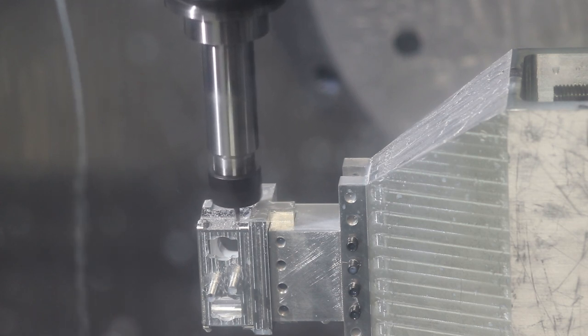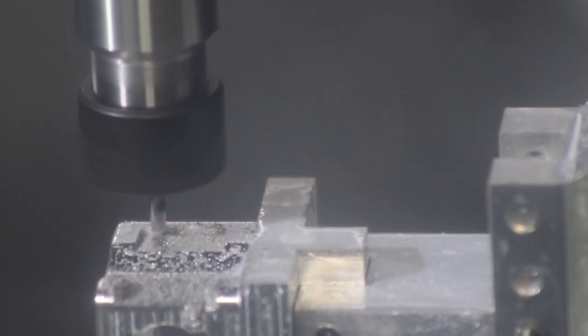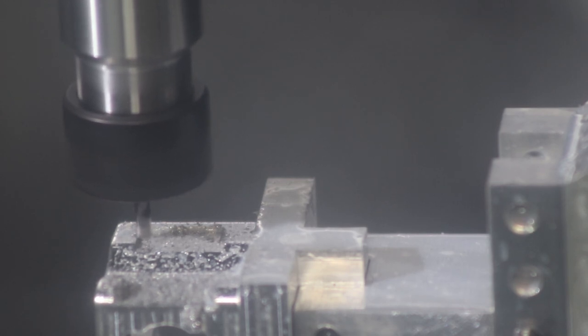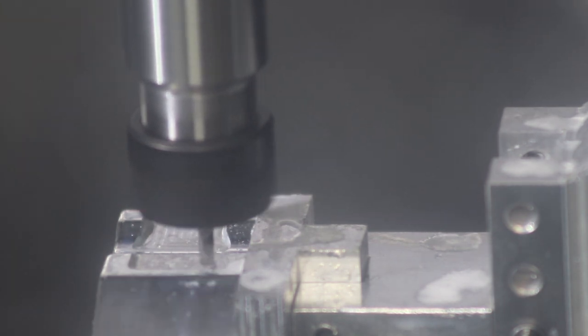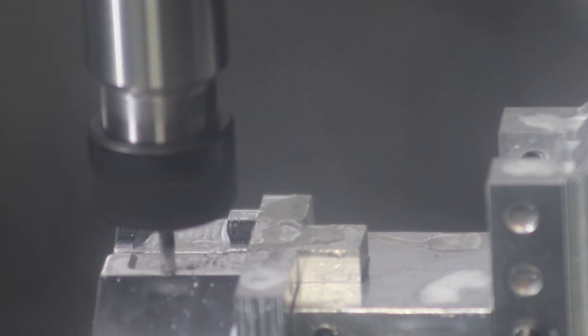Find a good spot. So it's just kind of scrubbing in that faceted face, picking up a resonance in the mill housing. There we go. It's going back and forth super fast. Oh, it's done. And now the other side. Now the spindle's spinning at 12,000 RPM right now. There we found the resonance on the enclosure of the mill. It's that ticking sound.